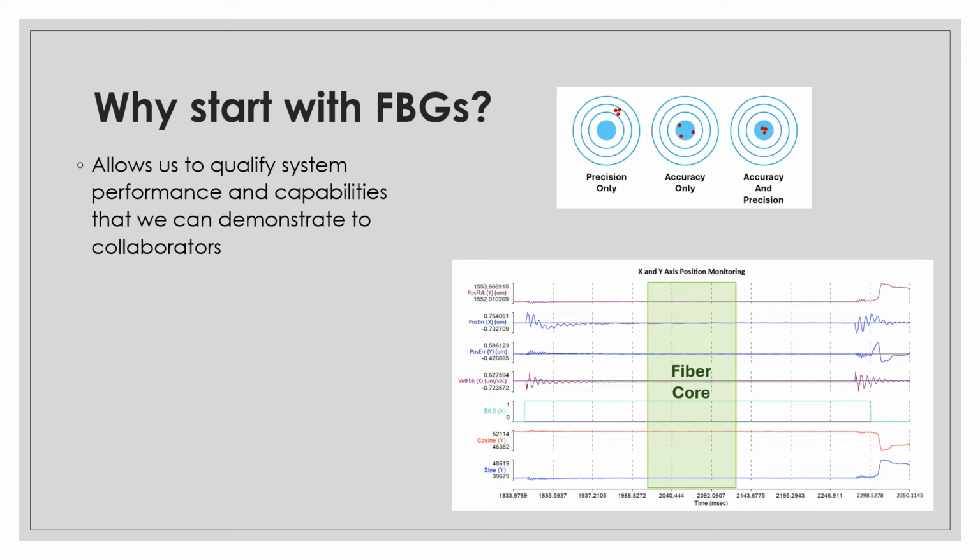What we really care about is precision. Accuracy and precision are both really good. Accuracy would mean effectively that whatever wavelength we design that we want to be writing at, say 1550 nanometer, we hit that right on. This matters a little less. We prefer to have high precision, because precision is what governs how closely each plane is spaced from the other relative to the position it's supposed to be in. So we want those planes to land at exactly the pitch that we designed them to be at, and if all the pitches are systematically off, or there's a slight accuracy error in the width of the pitches, that's okay. We just want to make sure that they're all very precisely positioned relative to each other. So this is important for generating very narrow grating resonances, very narrow grating line widths. And so we managed to achieve that.